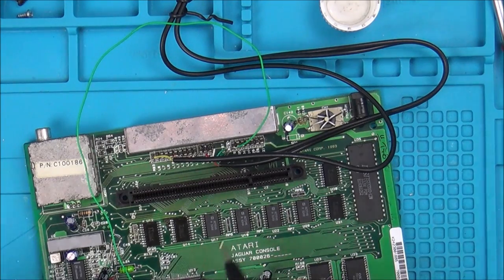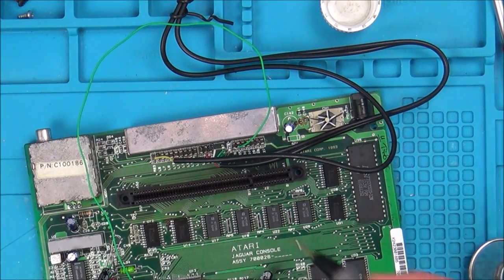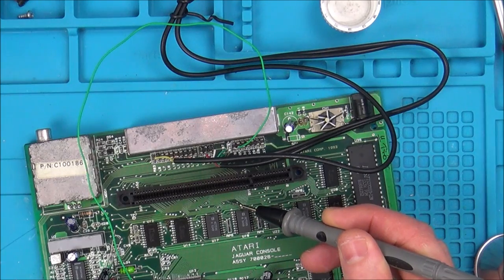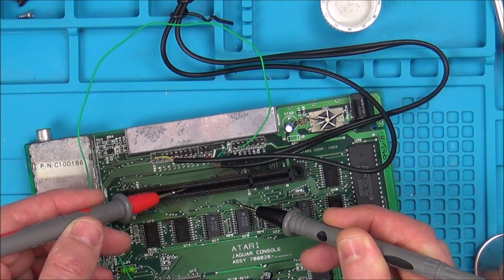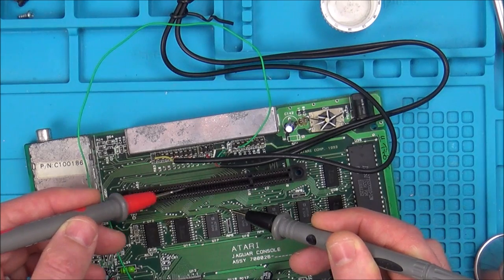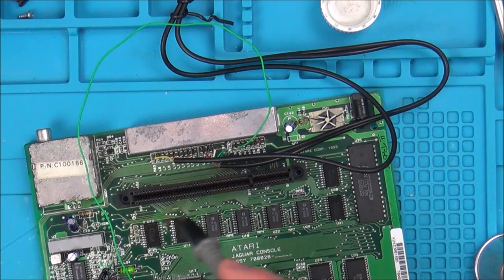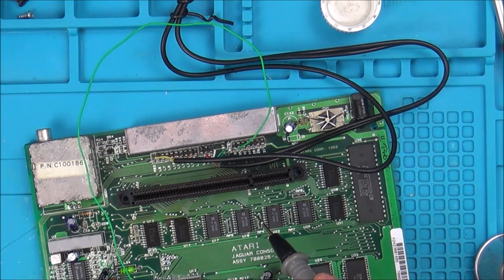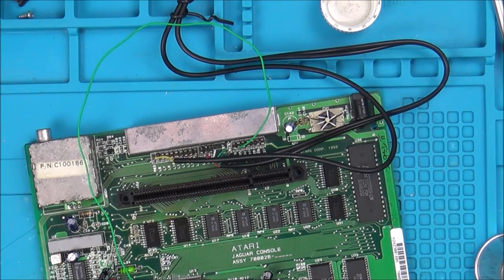But luckily I didn't take it off. Looking really closely through here, the ones that look like they're coming from here are going to the pins above. So for example now, if I was to go to this one here, listen. Can you see? It's coming up on the pins above. Another one. So I think I'm going to go across each of the pads here and see where they're coming up. And then if I have a missing pad, maybe I can just trace that back. Or I could even go onto each of these ones here and just keep rubbing along here until I get to where I need to go.